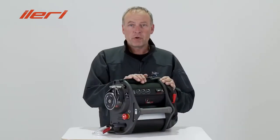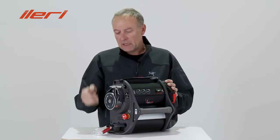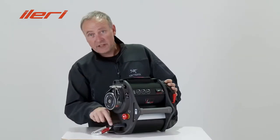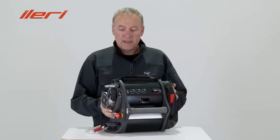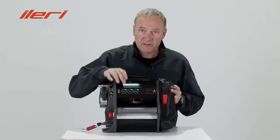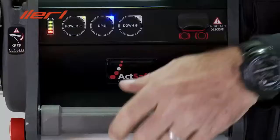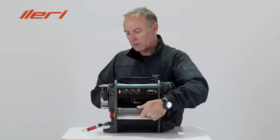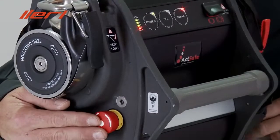Before going on the ropes, be sure you are using a fully charged battery. Check the connector, the sling, and the rope grab system, and then do a functional test of the winch — moving up, moving down — and also check the function of the safety switch on the side.